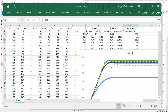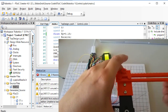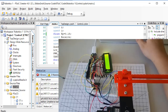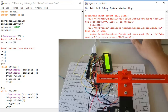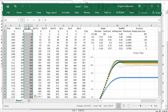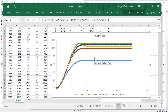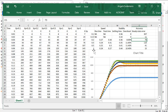Let's try a value in between — how about 0.15? Program the PSOC. Slide the slider to the right. Reset the PSOC, and then run the Python code. Copy all of the values from the data file and paste them into Excel. I'll add this to the plot. You can see that this plot is continuing to become closer to the 1,000 point. Let's see what the numbers show us — 0.15 still has no overshoot, but is too small.